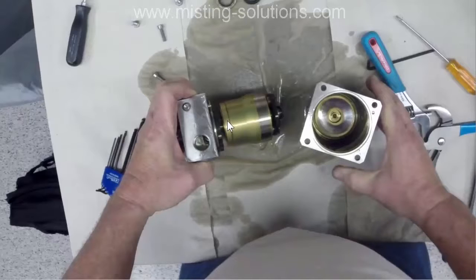And then this part right here is a valve assembly that lets the water in and water out. But then again, this whole thing is water lubricated. This whole thing is always engulfed in water inside the case. And so you can see that it's very important that this unit have water in it all the time. So if you run it dry or lack water within this thing, it's going to damage it pretty well. So you can't run it without water at all.